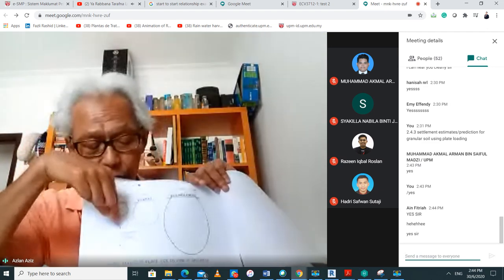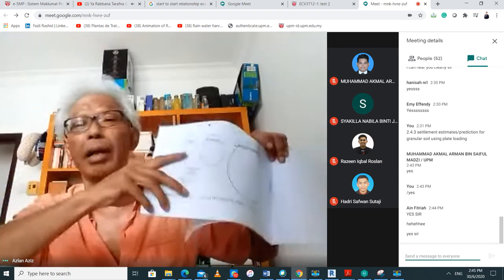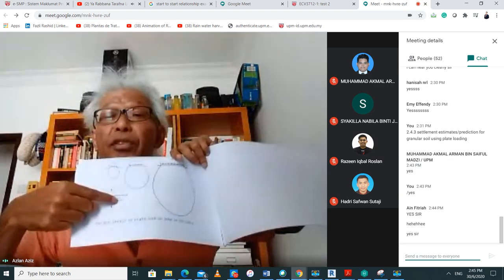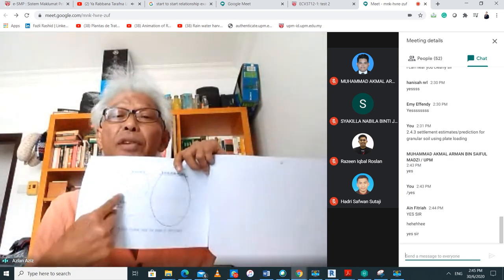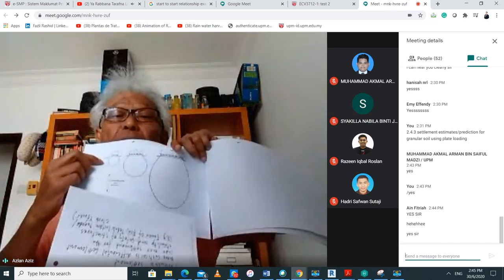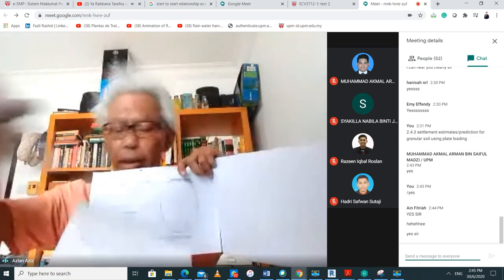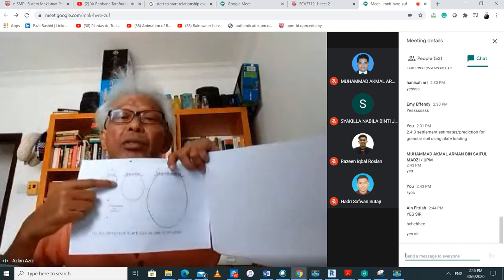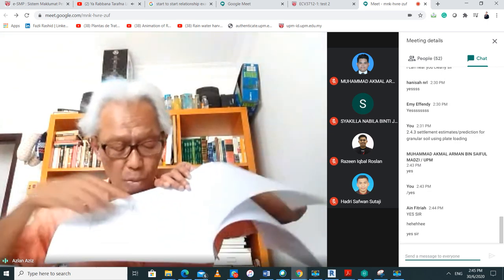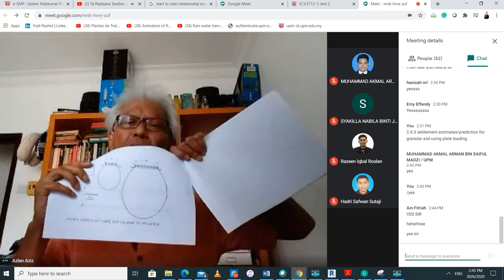Now, for this soil here, it is within the confines of this layer of soil, right? Now, if I have another layer here, where the bottom layer is different from the top one, it is not uniform. But the assumption here is that my stresses are constant with depth. So this doesn't apply because this is two different materials, and this is worse. The last one here is worse because it covers three different strata of soil, all right?